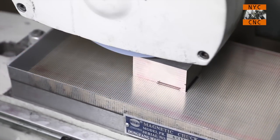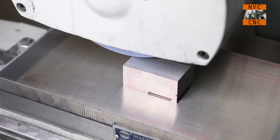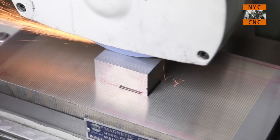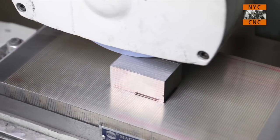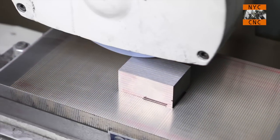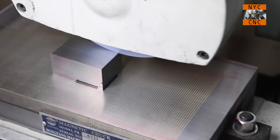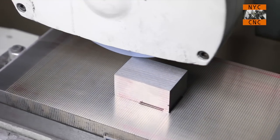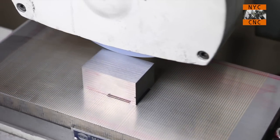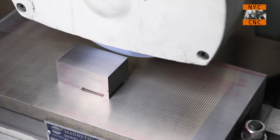Fast forward here till you can actually see the part. Now on the camera's viewfinder, it looks like there are little lines running along the x-axis. You'll see when we take this part off that it actually has a great surface finish. It may not be the same as a 5,000 pound grinder, but it's really smooth, and when we put it on the indicator, you'll see it's real steady. So I'm actually happy with that.